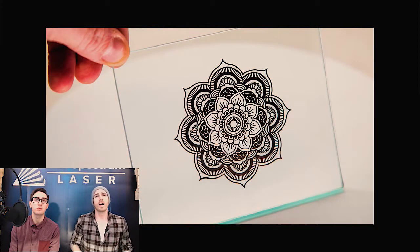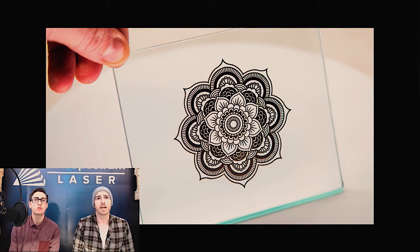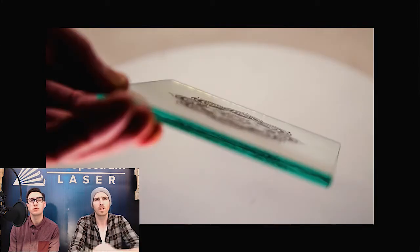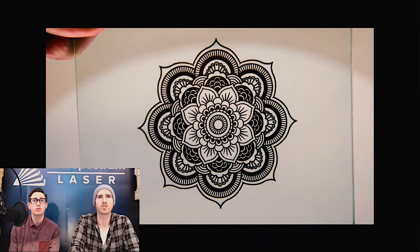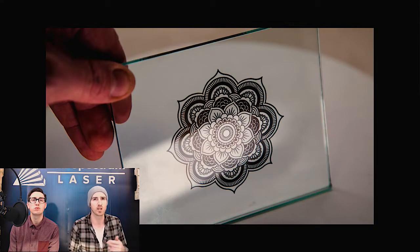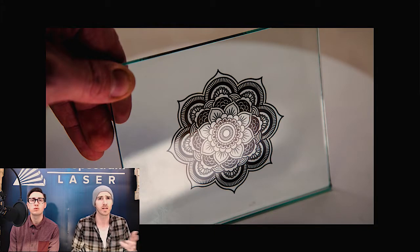Definitely. Here's just a few photos, if you guys wanted to look at these real quick, get some of the detail, see how it affects the glass in through the side of the pane. Really, really neat effect here. Now, again, the fiber laser doesn't typically affect glass, so you can't use it to etch onto glass, but you can use this method to do a nice dark mark on glass without using any sort of additive.